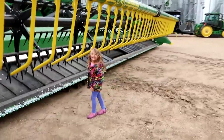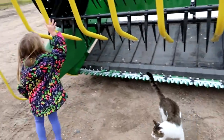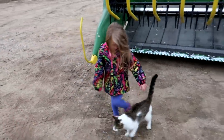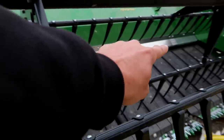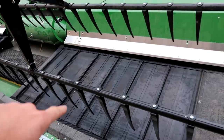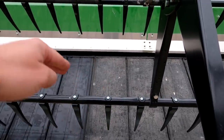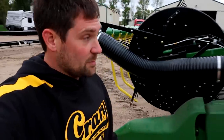The air actually comes through the tubes on the side, down the back, and gets driven off the feeder house of the combine through this fan — driven off the PTO shaft coming out the side of the feeder house to spin this centrifugal fan, blow the air up through there, and distribute it out through the head. I also wanted to point out the brush kit we installed at the back of the header. With the air system, you can have issues with it blowing too much chaff or too many beans into the back and have issues with the draper belts. What this brush kit does is stop anything from blowing off the backside of the belt and keeps the stuff in line until it flows to the center.